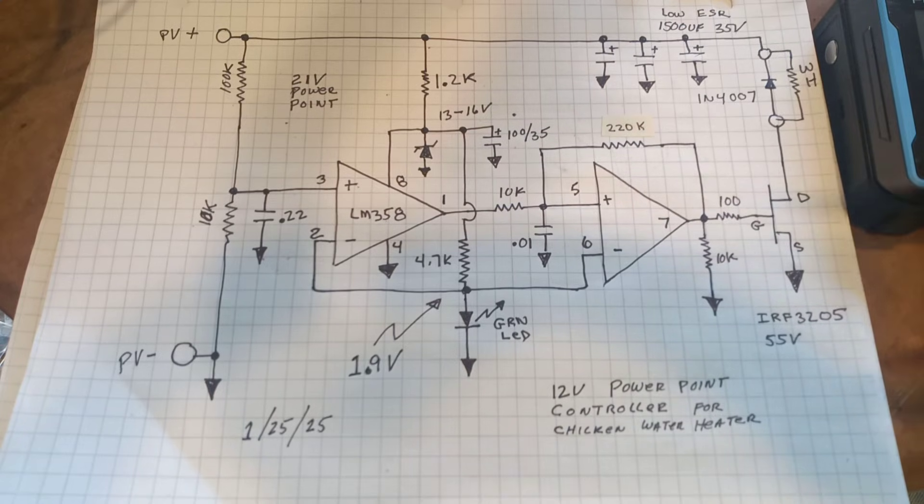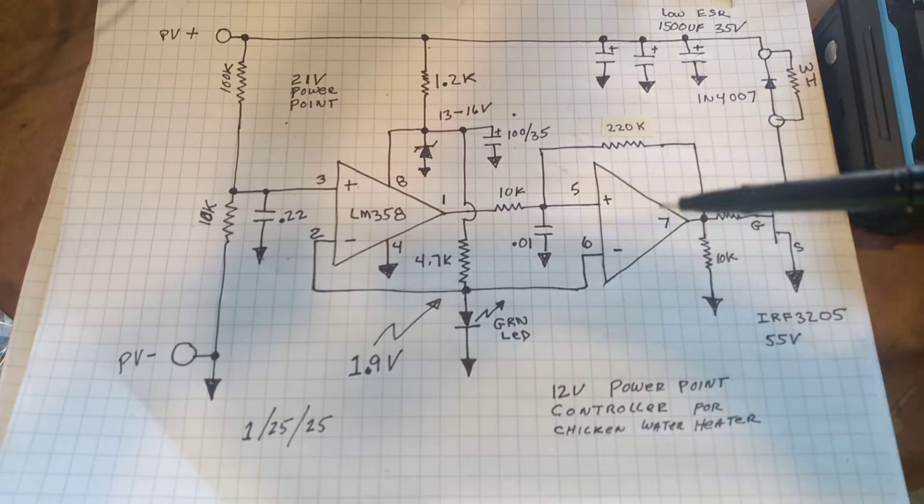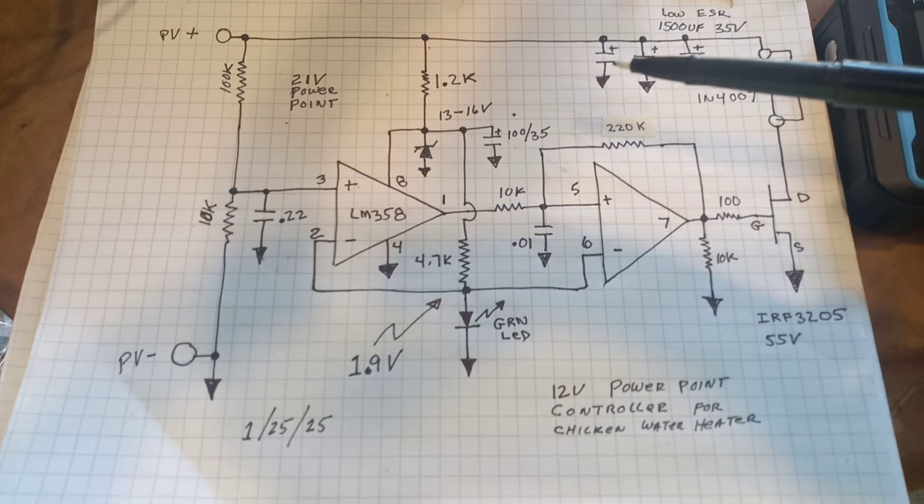This is about as simple as you can get — very cheap, common parts available anywhere. If you have an old PC power supply there'll be an LM358 operating as a current sense amplifier. An old UPS would have a couple FETs — they'll have an H-bridge in the output if it's not a low-frequency transformer type, and those will be at least 10 amps, probably in the 20–25 amp range. Put four of them in parallel — plenty good for a water heater. They'll be at least 200 volts, so you could build this for almost nothing. Old TVs will have capacitors — 220uF, 470uF.